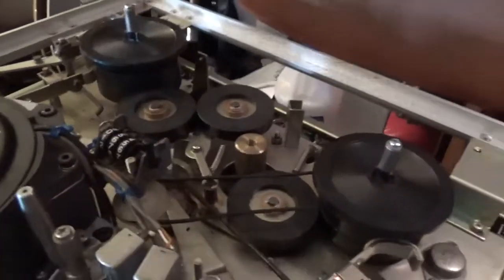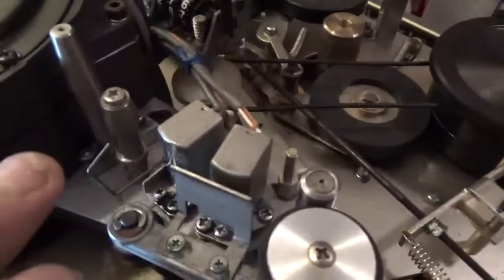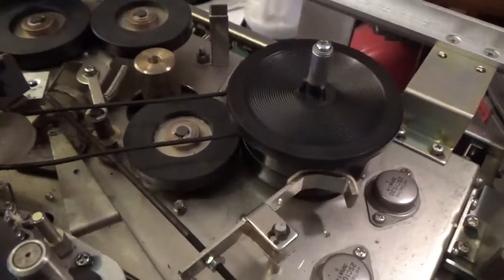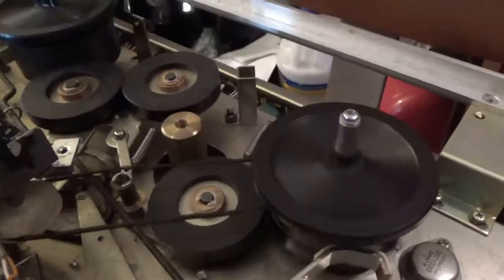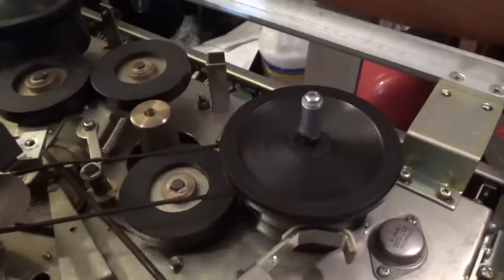Back to the drawing board. Okay, I'm stupid — I figured out why the reel stopped. I forgot: this is the tape sensor, so I've got to push it in to simulate that there's a tape. Push it in far enough, now it's going to run. If I let go and it drops down enough, it triggers the switch and thinks there's no tape, so it shuts the reels off — but it doesn't shut the heads off.